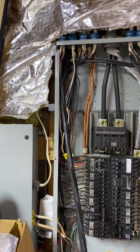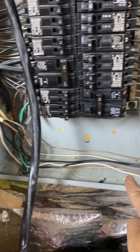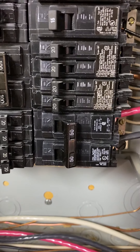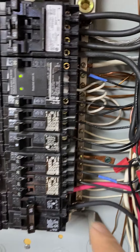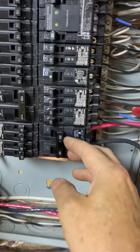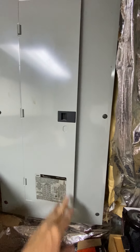We got the wire brought into the box. I'll strip the sheathing off right here and bring this down, around, over, and up into the new 50 amp breaker. Job complete — got our red and black, we've got the white and the ground up on the bus bar. Wires come around and go up. Only thing left is to put the cover on and we're done. Cover on — job complete. Thanks for watching.